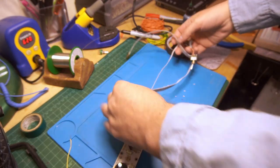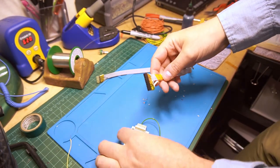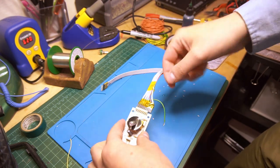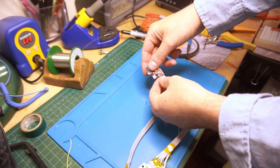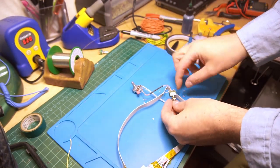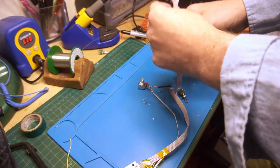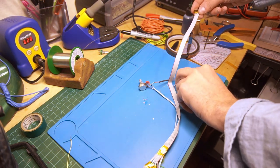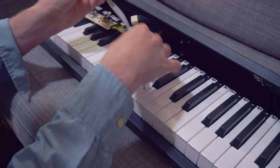All set up here. We've got the socket on one side and the ground pin and the 5 volt pin, or maybe 3.3 volts, is jumpered over to these two extra pins. And those two extra pins are wired to the outer lugs of this potentiometer. And the center lug of the potentiometer is wired with this resistor and capacitor to this switch, which is in the middle of the outermost leg of this cable. So this will plug into the main brain of the computer, and this switch will toggle the main brain from receiving feedback from this potentiometer or from the joystick on the control board.